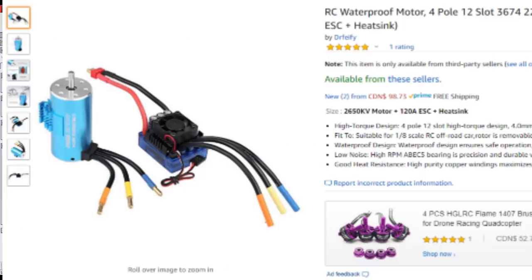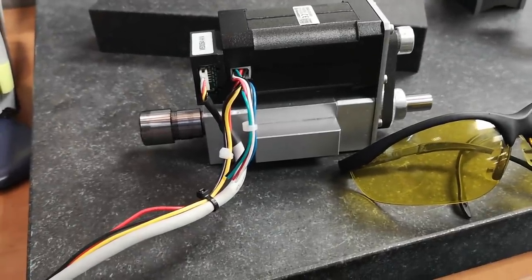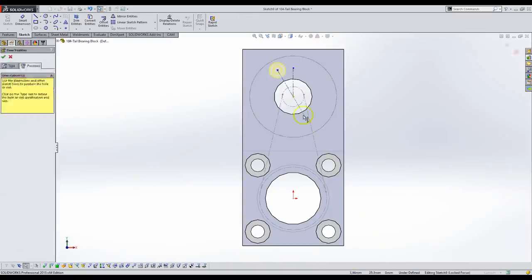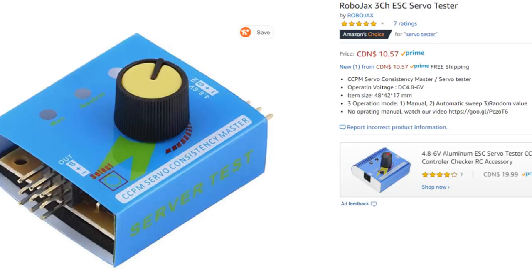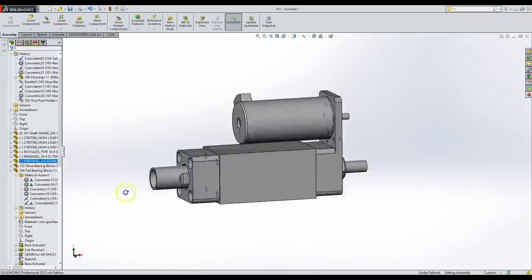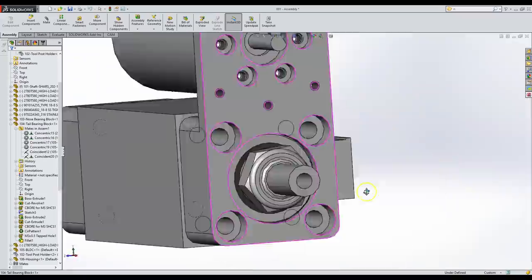I used a hobby brushless DC motor. I tried using a really high-end, super precise NEMA 17 brushless DC motor I had lying around, but it just didn't have enough torque. If someone can tell me why a NEMA 17 BLDC is 50 watts and this hobby BLDC is 1800 watts, I'd love to know. Obviously the hobby motor can take a lot more current, but is that it? I controlled the hobby motor with a hobby servo tester and attached it to an electronic speed control, powered by a 24-volt, 15-amp power supply. The hobby setup was designed to be powered by a battery, so it needs much higher current than 15 amps, but I found it sufficiently terrifying to do the job.